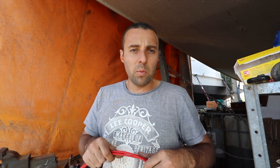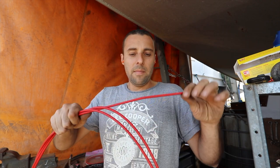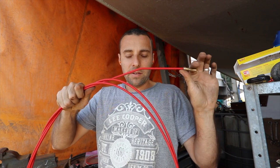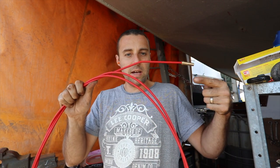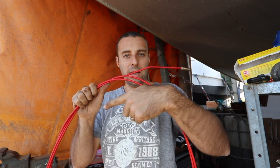If anybody has ever walked around a welder, welders get a bit paranoid about people kinking up their welding cable. That there is a cable that's been kinked. So this is a liner. This is what they're worried about, is basically that happening, because the wire has to feed down here and then go through the kink and head off to the gun.